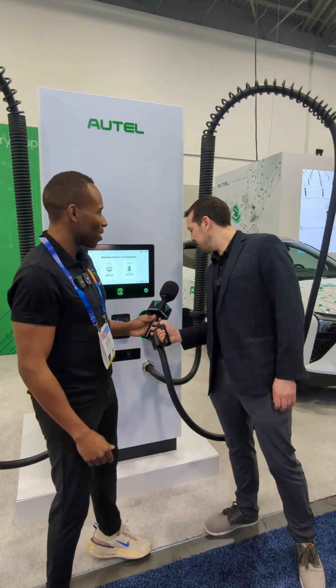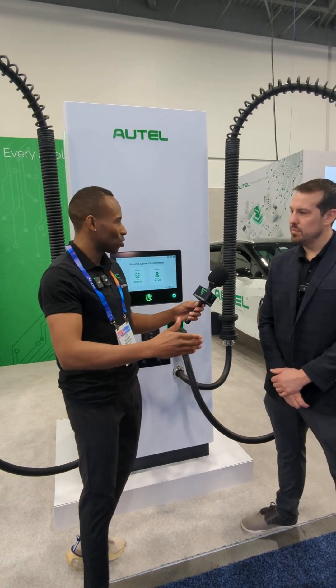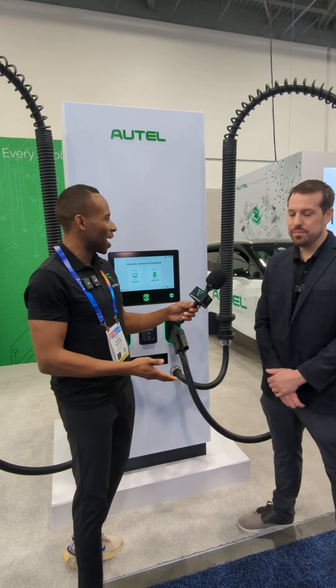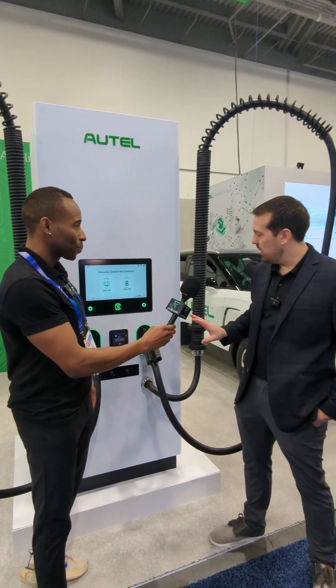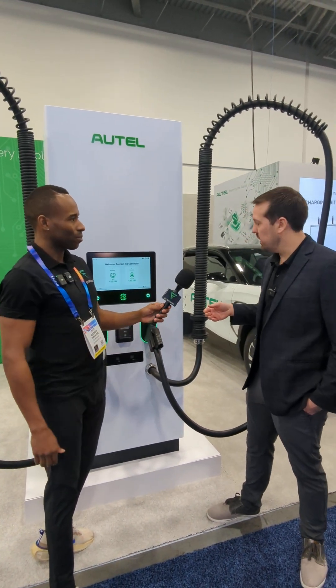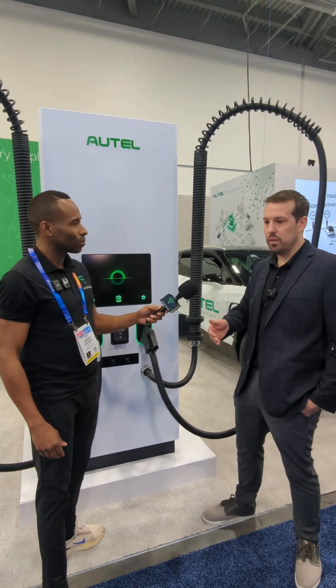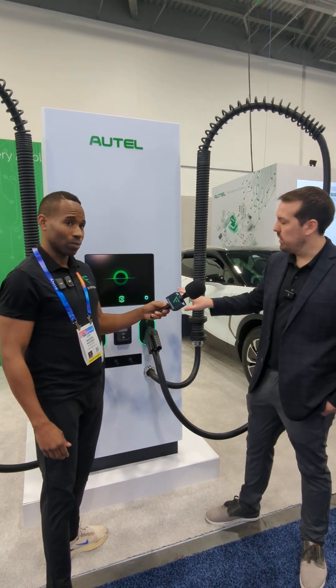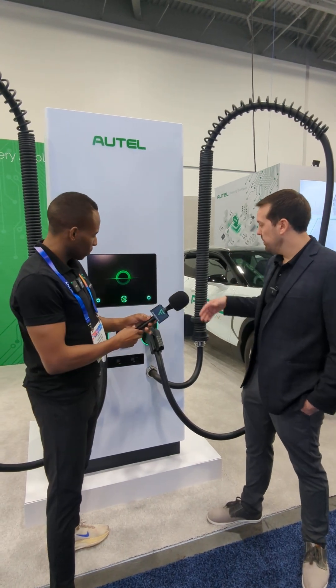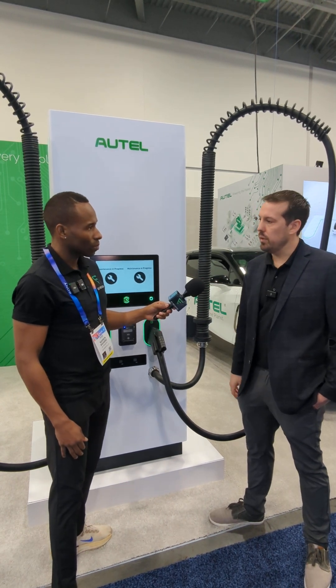I'm now really considering going mainly NACS because we're building for the future — thinking about the next 10, 20, 30 years because we own the land and it's not going anywhere. With our products though, if you do one of each on, let's say, four chargers at the site, in the future if you see that the utilization of the NACS ports is way higher than the CCS, you can actually retrofit. You don't have to replace the charger — you can retrofit this to a NACS cable. There's a different CCU, different firmware, but that can be done in the field and it's a relatively quick swap.